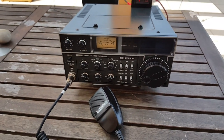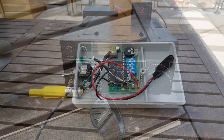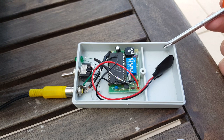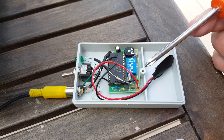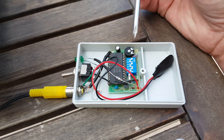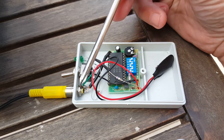I also want to test a tone generator I made — actually a tone generator board I bought and installed in a case. The board I bought from an eBay seller in South Africa — I'll post his username. I got a plastic case with a 9-volt battery compartment. I put an LED in here, a switch, and an RCA connector. The wiring is very messy because I was in a hurry, but I hope it's going to work.